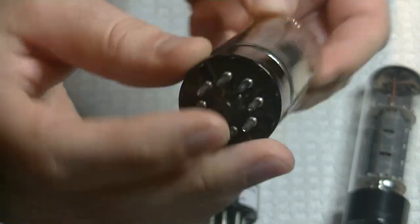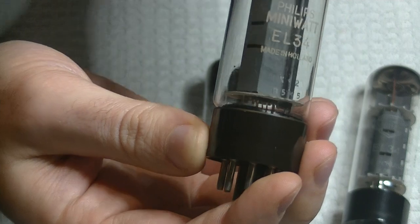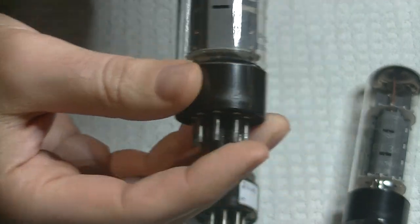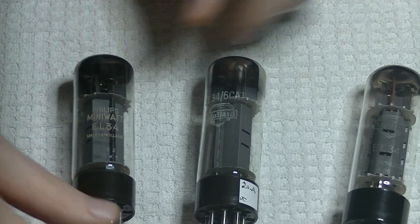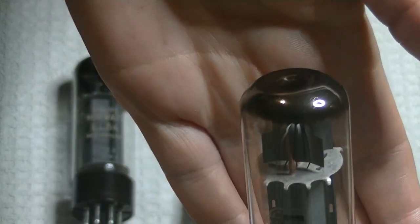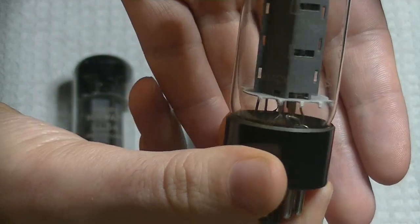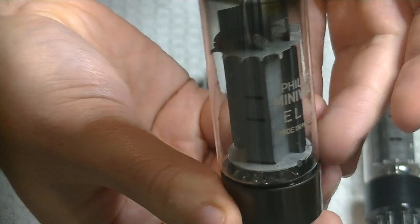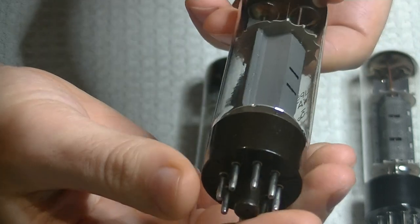What are the identifying features? We've got welded plates on each side and there's the center hole on the bottom of the tube base. The upper mica spacer really distinguishes it - it's got these interesting claws but only on about half of it. You'll see a gap on each side - that's a real tell. If we go back to the reissue, they've attempted to copy that feature too, and they also did it with the bottom mica. Whereas on the original, the bottom mica is simply round.